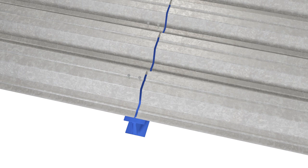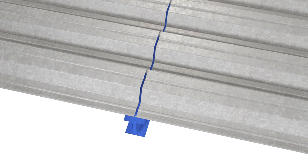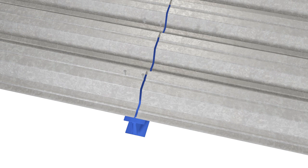Minimum end bearing onto a steel beam is 45 millimeters and edge distance is 9 millimeters. Spacing between fixings is 16.5 millimeters when you have more than one fixing. These fixing arrangements are typical and would need design checks for each project.